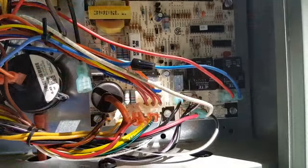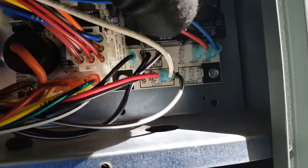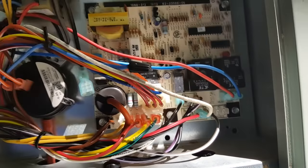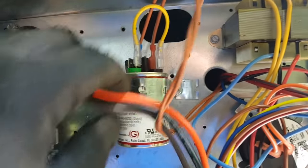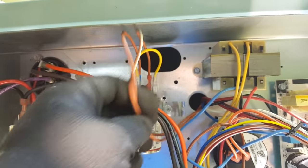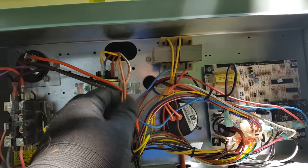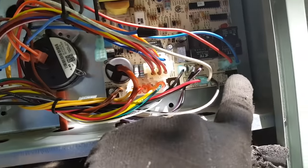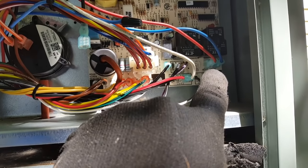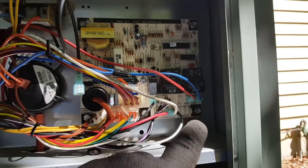We have our two speed taps — low speed for heat, medium speed for cool. I'm going to test those out and may switch them up. I have the high speed sitting here as a spare right now. We have a capacitor in an AMRAD mini turbo setup for 10 microfarads — tested and approved. The old relay is abandoned. Our two capacitor wires from the PSC motor go to the capacitor. The jumper makes the mini turbo 10 microfarads instead of 7.5. Two speed taps off the board — one for cooling, one for heating — just like they came from the factory for PSC, which they just adapted for the X13.